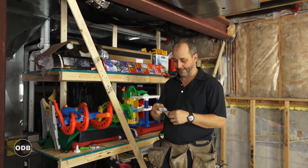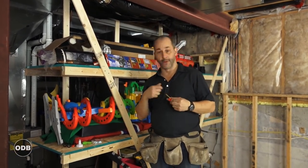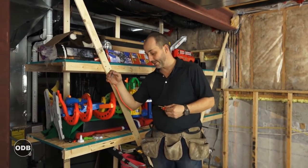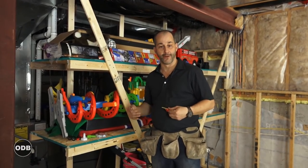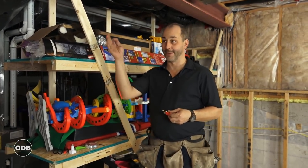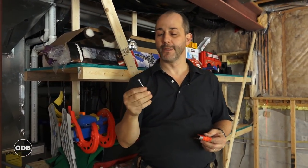This is a separation wall for our living room to a storage and mechanical room area. We're going to do a platform frame, all spruce lumber — don't need anything special. Because we have our subfloor with our vapor barrier and airspace underneath, I consider this to be a 40-year build. This wall is going to be here years and years after anybody has bought and sold a few times. We're going to build it, stick it up in our hole, and then use these bolts — they're awesome.